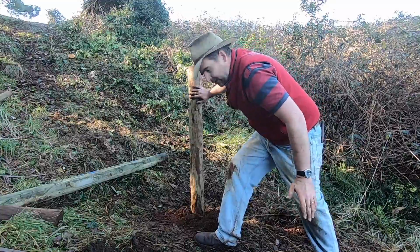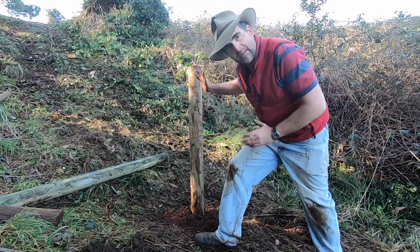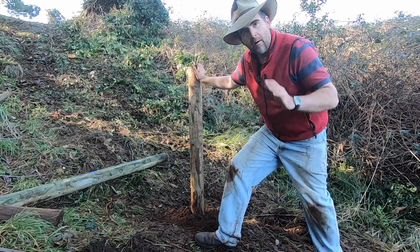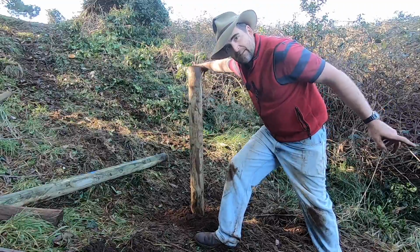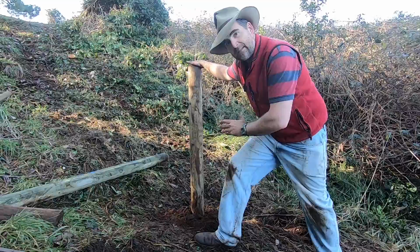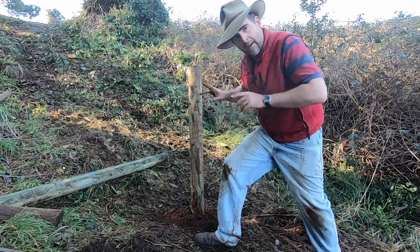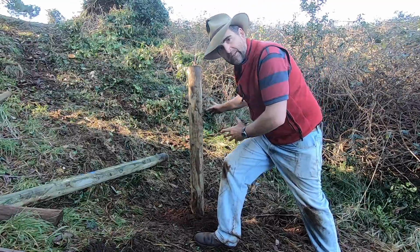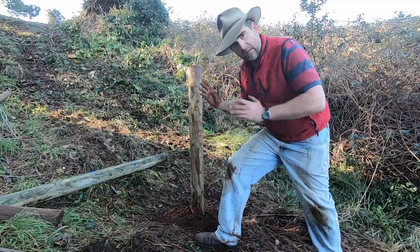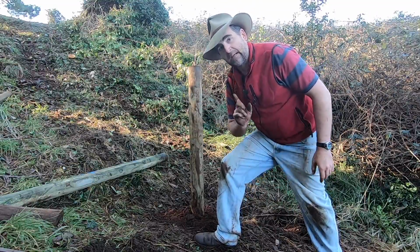So we put in the middle of the three posts because that's going to allow us to get precise measurements up and down the fence from the one that's going to be at the pinch point. What we're now going to do is measure out the next two posts so that I can also fit a top rail to these and turn this into an end assembly. So we're making a choice to come to this central post from both directions and actually strain up to this post as well. You don't have to do that. You can just gut strain your fence and attach it to this post, but the next step you do regardless.